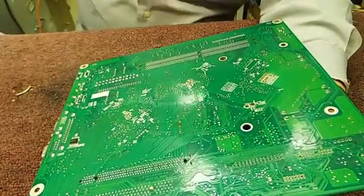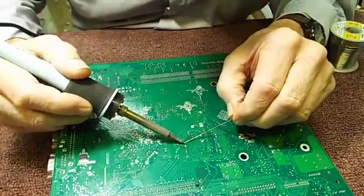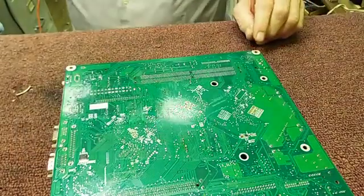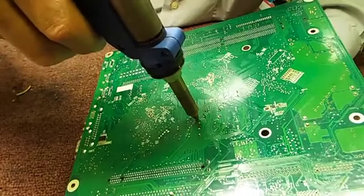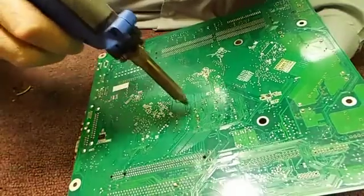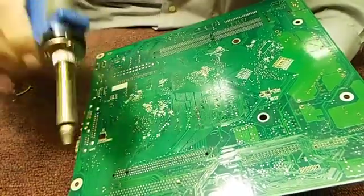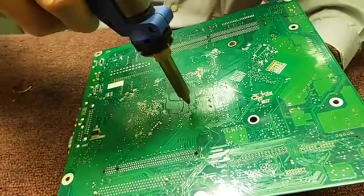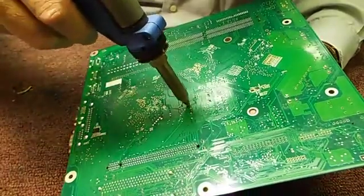Make sure that my tip is up. With this method too, you also want to add a little bit of solder — just to get it sort of started. Then take your solder sucker, get it on there, melt it, wiggle it around, and suck. You wiggle it around so you can feel the edges of the pin hitting the sides of the hole. And when you can feel that, then you give it a pull — you know that you've got it.